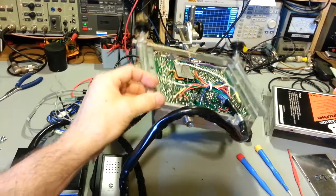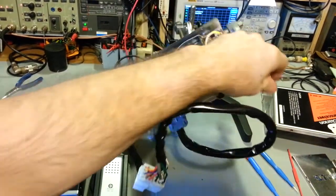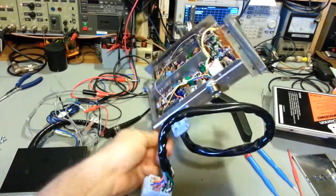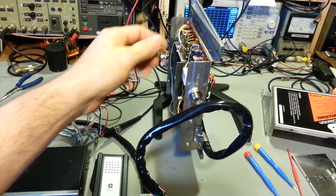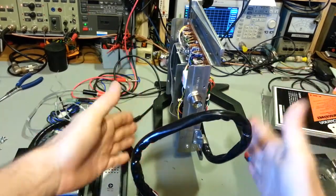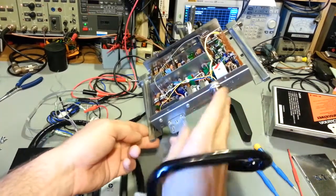But yeah, that's all it is. It's just a printed circuit board holder. It has a nice, real heavy cast iron base to it. But it really makes working on stuff like this very easy. I actually used this when I recapped it, because you need to be able to pull the capacitors out from one side and desolder on the other side. So the radio needs to be sitting upright like this. This printed circuit board holding jig works really, really well for working on stuff like this.